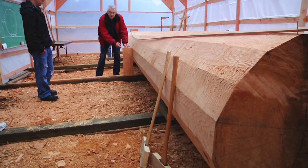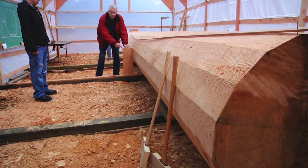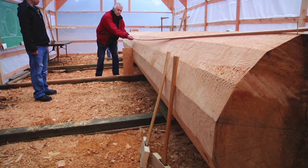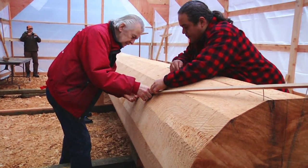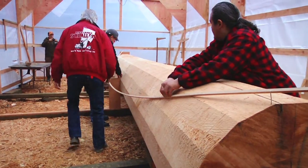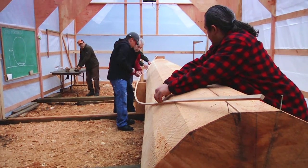This is going to be where the finished gunnel will be after you spread the canoe — 8 inches out from there and 22 inches from the base. Crew members are stationed at each end of the faceted log, holding the spline, but allowing it to be pulled outwards at the middle to the desired post-spread width and height position.